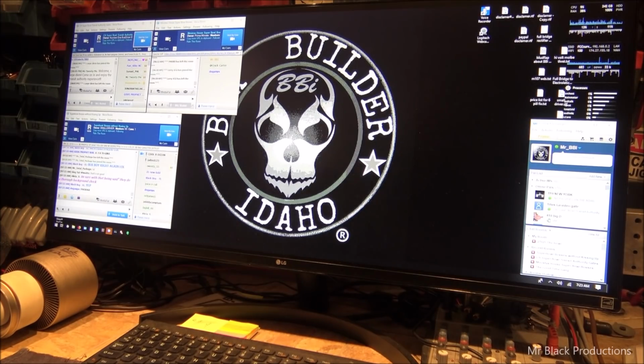How do we do that? Our input side. If I know for a fact that my line voltage over here is 240 volts, which I know it is, 242.5 volts is what I get from Idaho Power, I can calculate out from my input voltage and dial this number in pretty tight. Now, I don't know what my customers are going to have if they're in California or if they're in Pennsylvania or if they're in Connecticut. The voltages across the grids in the distribution network across the United States are very tightly regulated. But when it comes down to actually getting it delivered to an end user, there's always a little bit of variance.